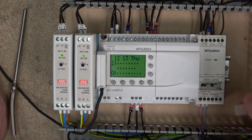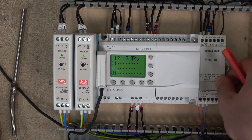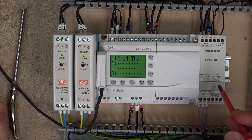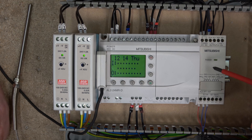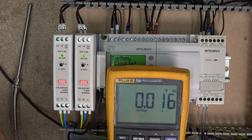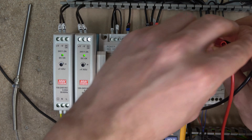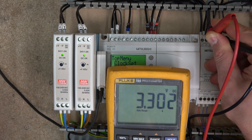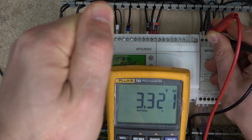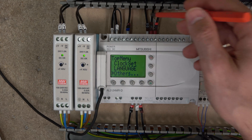The standard is the resistance in there, and if you want to arrange it differently you can use the jumpers in here to adjust to whichever range you are working within. Because we're going to be working on the standard, we'll leave it at that. From there it converts the signals coming from the temperature probe's resistance into a voltage. As you can see, the card is powered up and there's a meter — I have 3.302 volts. As I put my hand on the probe, the voltage starts going up because the resistance is changing — that's pretty much what is happening.